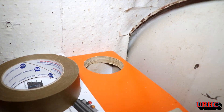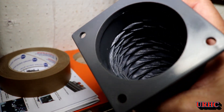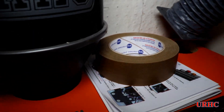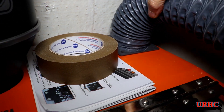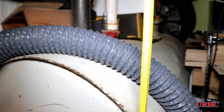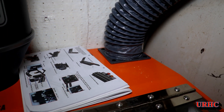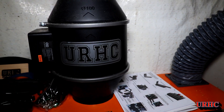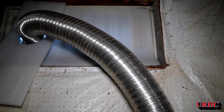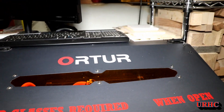What I'm going to do is just drill a hole in the back corner of my other enclosure and have this fan blow the smoke into there, then use the main fan to move it out. That way I can actually run both lasers at the same time and I don't need another vent through the window or another flapper valve. There you see I got that one into there — smoke blows in, and the main one has a valve on the outside so cold air can't come back in.